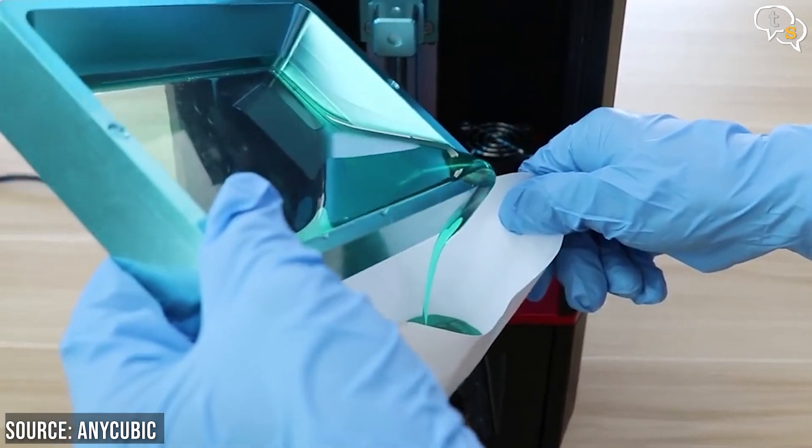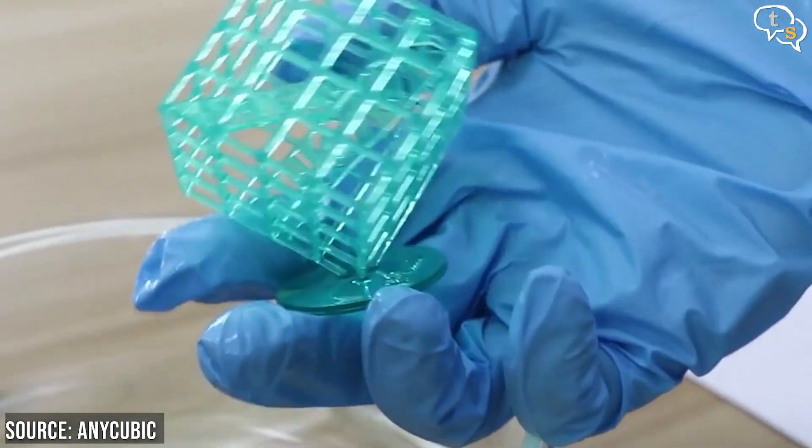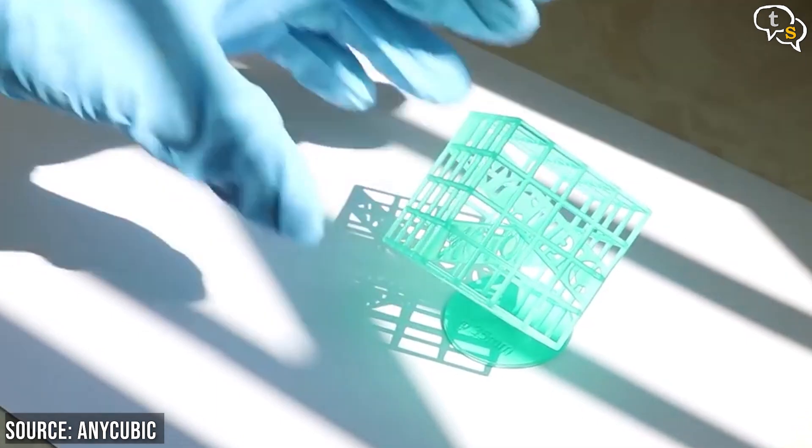These models have very high detail and are also used to print high quality miniatures. One drawback is that this method does not allow for usage of multiple materials, so you will get a model with one colour only. FDM allows for dual and more extruder setups which allow for multi-colour prints. Another important factor against DLP printing is that the materials used are hard to work with and can also be toxic. These 3D printers are also a bit more expensive, and the availability and price of materials are on the higher side. The prints are dipped into isopropyl alcohol to clean them and either set out in the sun to cure, or you could get a UV lamp to cure it. DLP printing is quite fast and accurate.